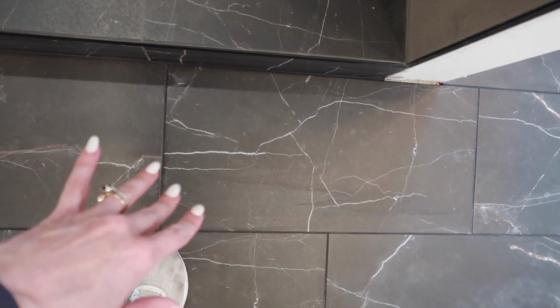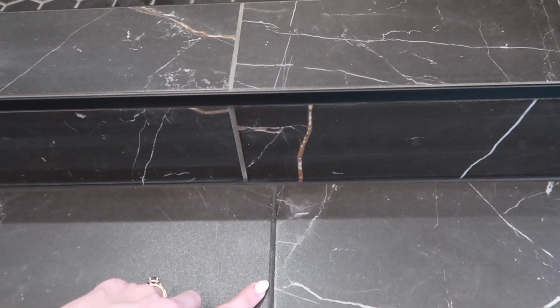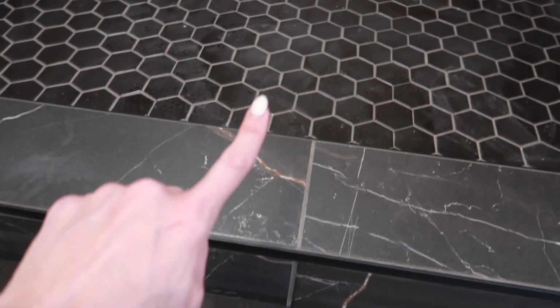And then for the floors, I thought if we have black tile on the floors, I don't want it to transition into another color, we need to keep black on the floor. I originally thought we could just do the same tile as the bathroom floor in the shower, but then you learn a lot of things in this process. I learned that you can't have big, giant tiles on the shower floor. It gets too slippery. You need smaller tiles with a bunch of grout lines so that you're not falling on your ass every time you're taking a shower. So I looked at a bunch and decided that the black matte little hexagon tiles were perfect and made for a seamless transition into the shower. I had them use the floor tile for the rest of the bathroom over the transition into the shower so that it was really seamless. I'm just really happy with the decisions we made and how it turned out. It looks so good.